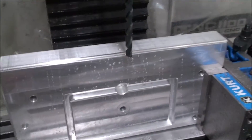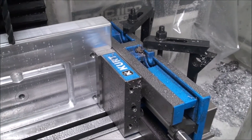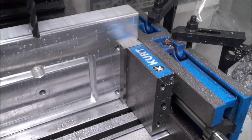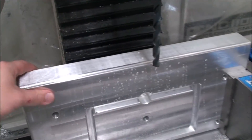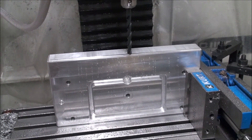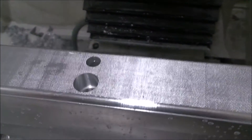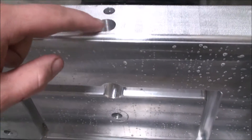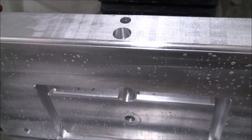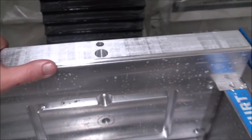About to do the drilling operation on the front. Not sure how acceptable or how rigid this is going to be - it's all squared up and everything, but it seems pretty rigid. I couldn't get a lot of flex out of it putting a dial indicator on it, so hopefully this will be rigid enough. Well, that actually went really well. All the holes looked good, depths were all good, with a small amount of milling to clean that up. I was expecting a lot of chatter because of the way it's fixed, but it didn't make any noise at all - it was fantastic.